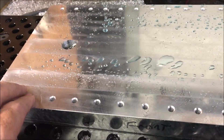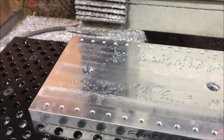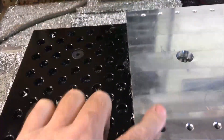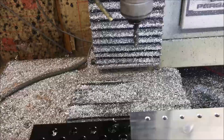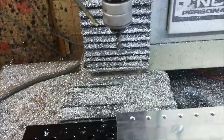Now I'm going to do the tapping. I'm going to have to change it into low gear for the tapping, which means I'll need to post a new file for it. I don't really have a whole lot of experience tapping in aluminum. This is going to be half an inch deep and I'm going to use the fog buster — I'll probably turn it up high to make sure there's enough lubrication so I don't break a tap. We'll see what happens.